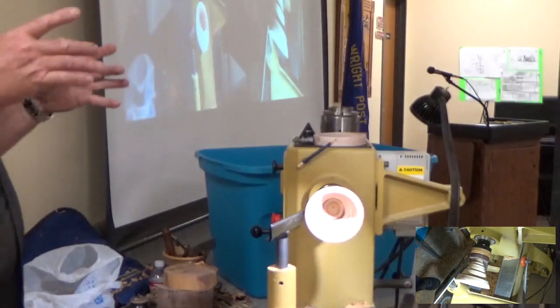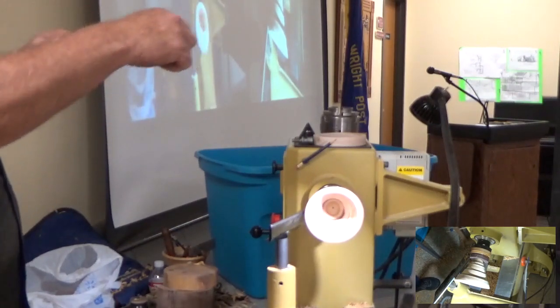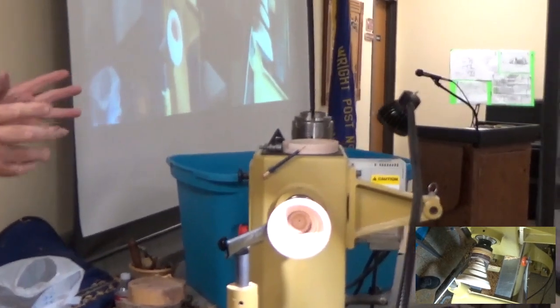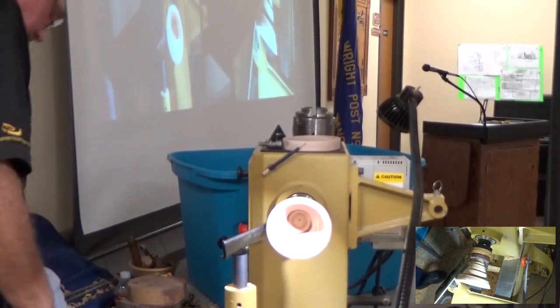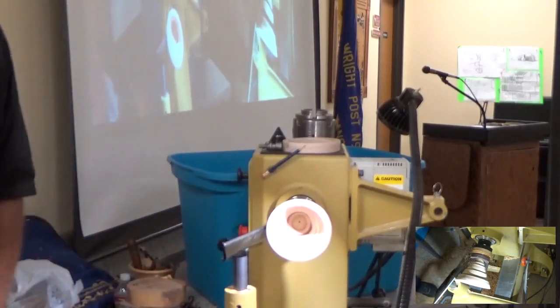But if you do like 2 boards, do a half ring on each side, then you can cut that on a bandsaw. Tilt your bandsaw at the angle that you need. And it's a lot more accurate that way. We used to call them 45-degree bowls. Yeah.